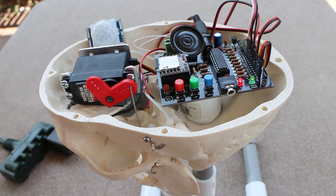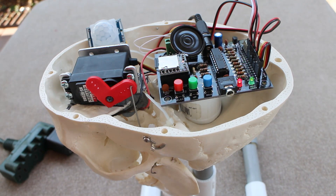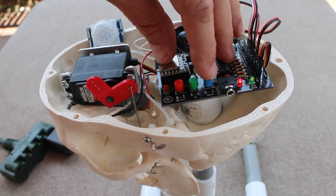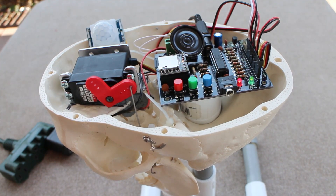Please use the green up and blue down buttons to change the setup menu item and press the red select button. We've already done 'Set jaw servo limits,' so let's go to the next item: LED eye style. Let's go ahead and choose that. Use the green up and blue down buttons to change the LED eye style and then press the red select button. Options include: eyes always off, eyes always on, or eyes on during show — which is my preference. Let's select 'Eyes on during show.' Selected.